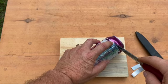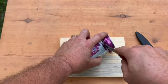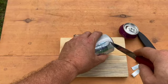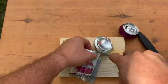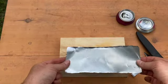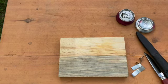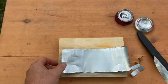I like to go right here on the flat part and follow one of these lines and carefully cut along, then cut down the side, and cut the bottom off. By cutting off the top and the bottom you end up with a long flat piece of aluminum that's easier to work with. I usually take this and rub it on the side of a log — in this case the side of my table — and curl it in both ways to get it to lay more flat.